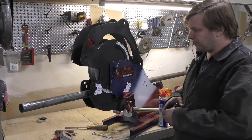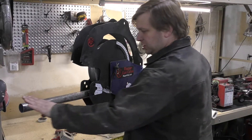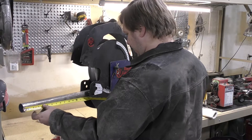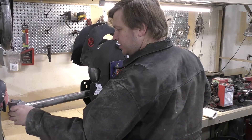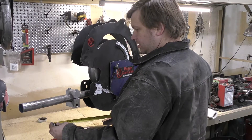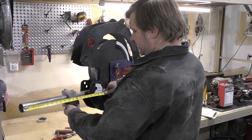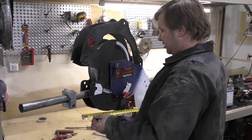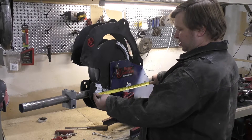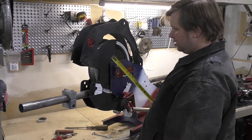The first stop with our front section is we need to make that front initial hoop, which should be big enough with this six-foot section. We need to come through and get at the 12-inch mark — get our clamp. Then we'll have 12 inches there at the clamp, and then we'll have an additional six inches of straight pipe before the bend starts.